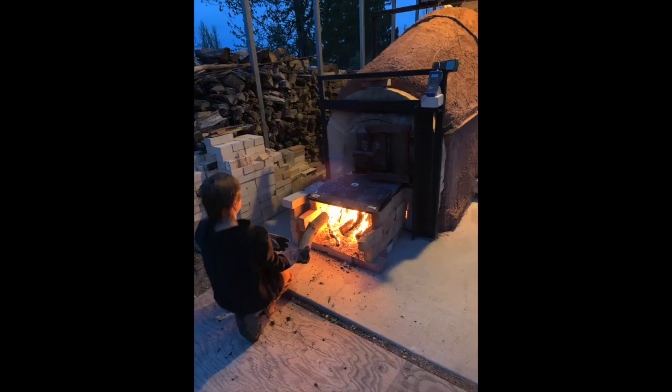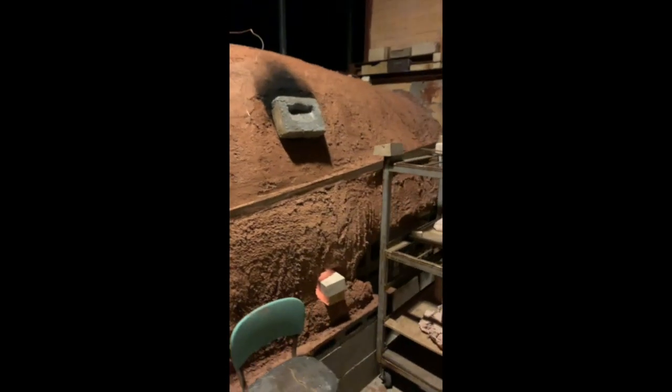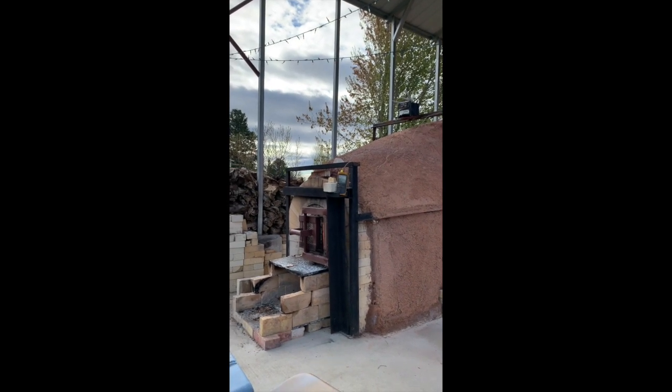Nice. There's Gussie helping me. Gus and Wyatt helped a little. All right, here we go. Second night. Nice quiet. Been going up to 2,122 on the pyrometer. 9 is bending already. You can hear how much velocity is going on in the kiln. It's pretty quiet, and just the sound of the kiln and maybe some whippoorwills. Morning is about to set in, and here comes the birds. It's less quiet.